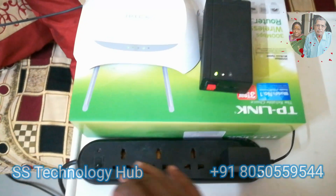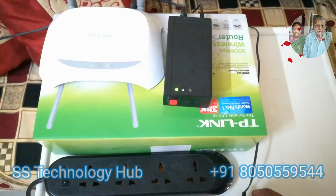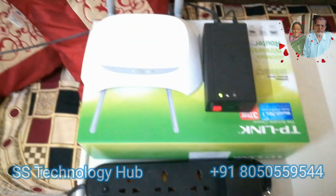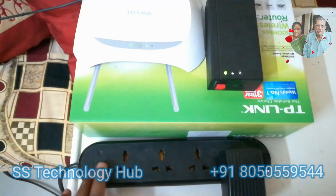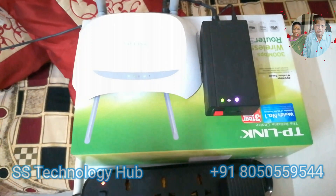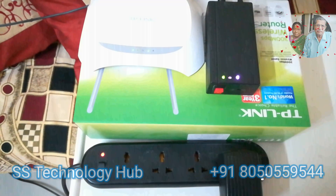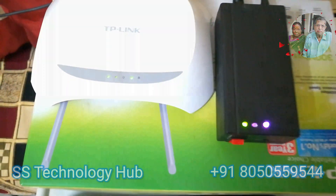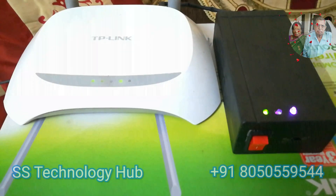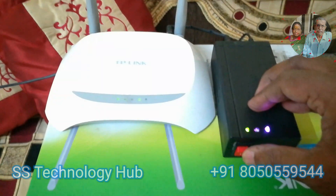Now let me turn off the power main and unplug the 9V 1A power adapter from the TP-Link router. Connect 12V 1.5A to the power main and turn on. The device will flash with blue and green LEDs. The battery gets charged automatically with protection against overcharge and over-discharge.